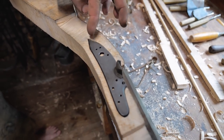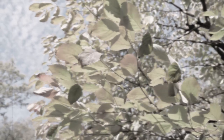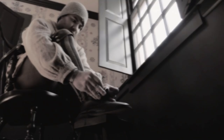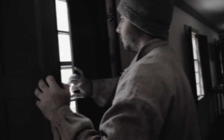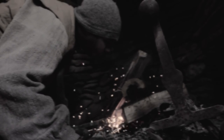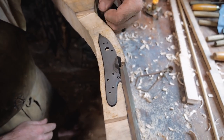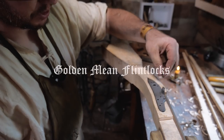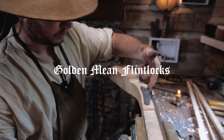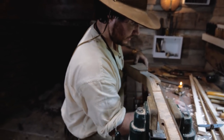Now when you inlet the guts for the lock, you want to be really careful and you don't want to pry your chisels, because if you're prying on them you're going to smash your edge. You just want to go straight in with the chisels and scoop it out instead of prying. Every once in a while you're gonna have to pry a little bit — just pay attention to where the stem of your chisel is so you don't get against your edge and cause it to cave in.